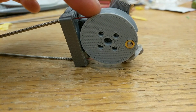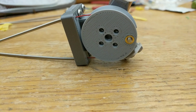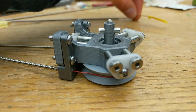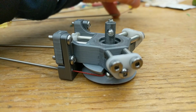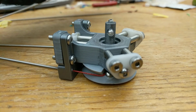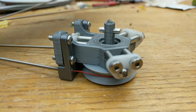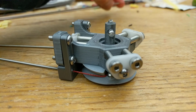On the back I've got a 3D printed pulley going into these little spring guide control cables, and on the other end I'm able to give it a tug from the other side, which is currently loose, and that actually does the actuation for me. So I'm able to engage and disengage the kinematic coupling remotely using these control cables.